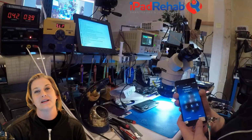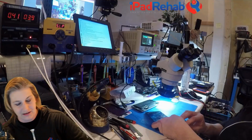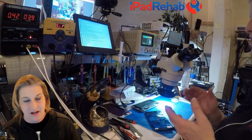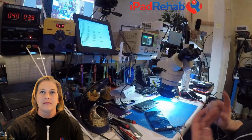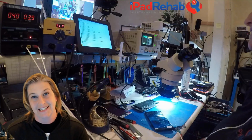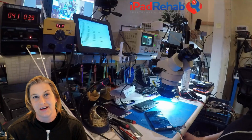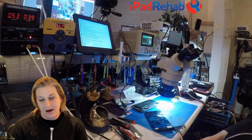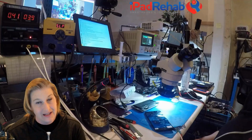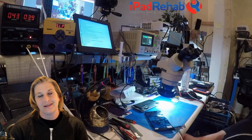But there you go. So what I like about this repair is the idea that, number one, not every problem is as short. This one was. How did we know? Because it has to tell us where it hurts. It told us heat. I'm getting hot. That was our clue to figure out we've got an abnormal DC power supply signature and we feel heat. That's a short. Then we said, how do we find the short?